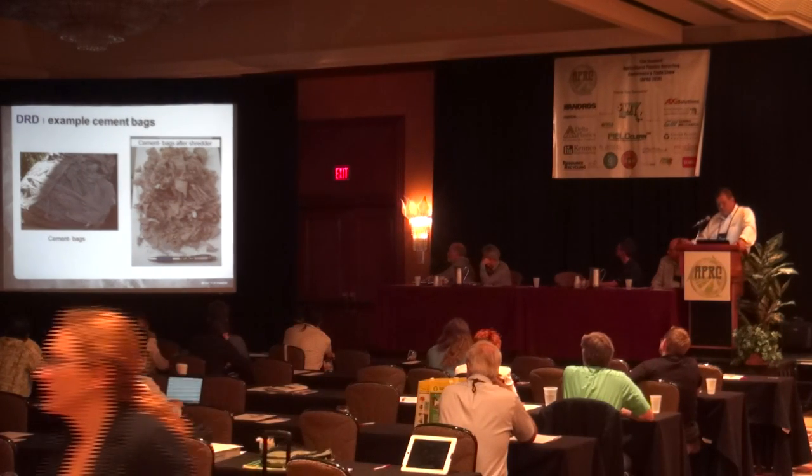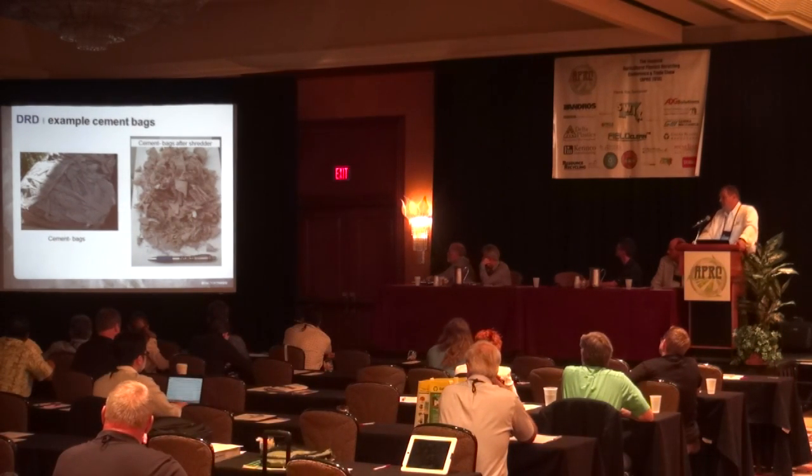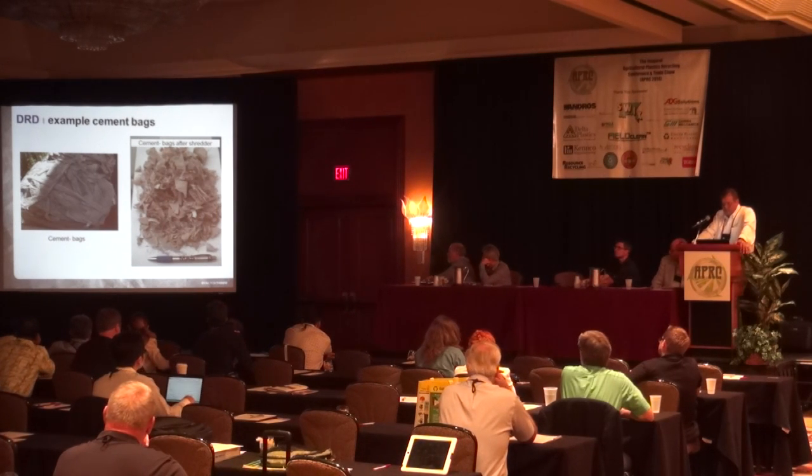Here's another good example for something that's very hard to wash, which goes away from the agricultural material. In this case, it's cement bags. Big bags have often things like this in it as well. Cement is very hard to wash because it cures under water. So we can actually get the cement residual out of the PP material and separate it out.